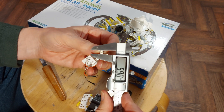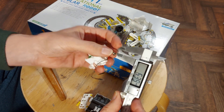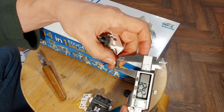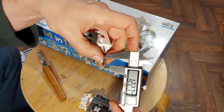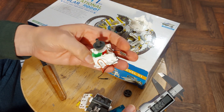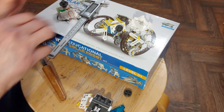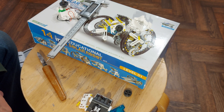So to summarize: 6 millimeters diameter, 12 millimeters long, with a 0.8 millimeter shaft. I'm guessing 1.5 volts — it might run on a 3 volt one, but it's going to be that sort of voltage. It's not going to be 9 volt or 12 volt or anything like that. It's going to be low voltage.